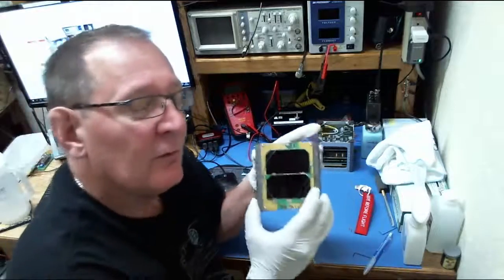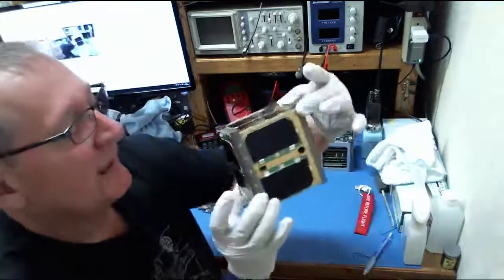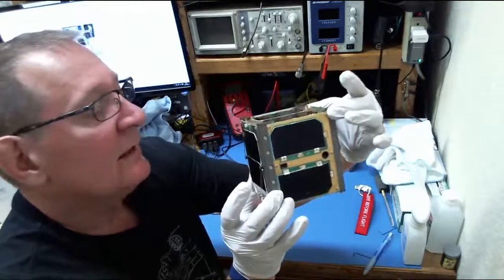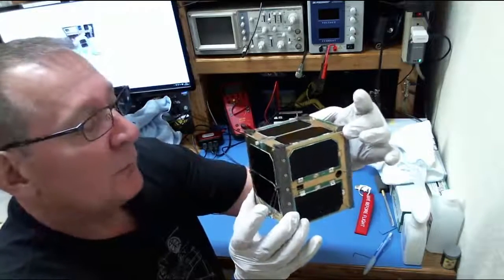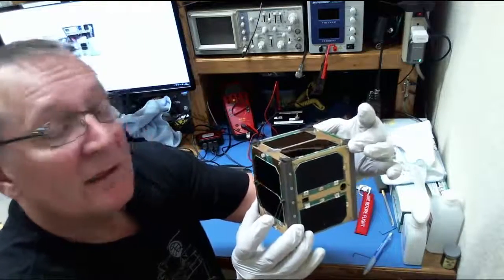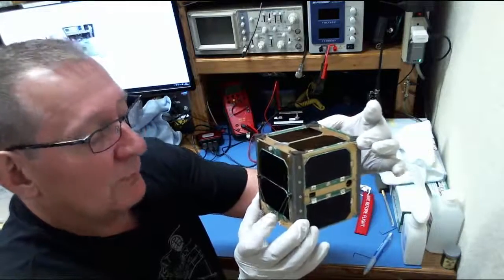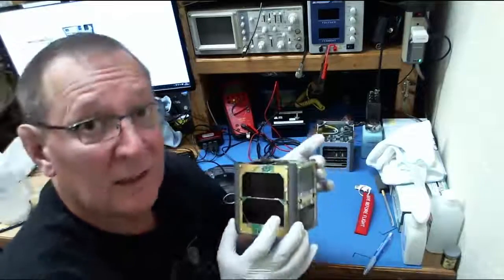You know, first of all, the polarity of the satellite, like if you're using your arrow antenna or whatever. As you can kind of see, the transmit down out the minus Z and the receive out the plus Z, they're linear with each other. Each of them actually forms a dipole. The 2 meter forms a dipole between itself and the body of the satellite, and the 70 centimeter antenna forms a dipole from the whip itself and the body of the satellite. So they are in the same plane.